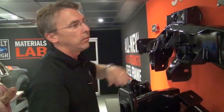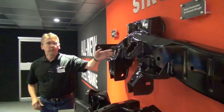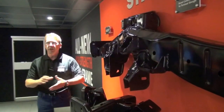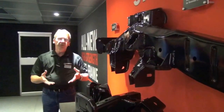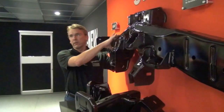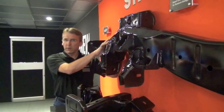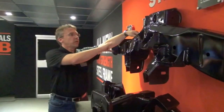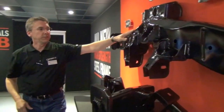Moving back on the front rail — on the current F-150, that's a hydroform tube. When we did that part, it was a new technology for us. The downside, as we got into the newer materials now at our disposal, is that hydroform means it's the same gauge all the way around. We wanted the ability to manage gauge, or metal thickness, to the inside and the outside, because I want to put the metal where I need it to do the work the frame has to do, but reduce it for weight efficiency where I can. Through high-strength steel and the inboard and outboard rail, we're able to take out a significant amount of weight.